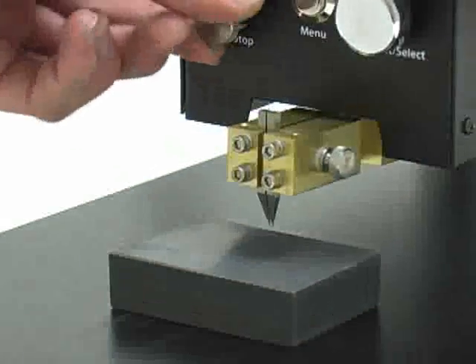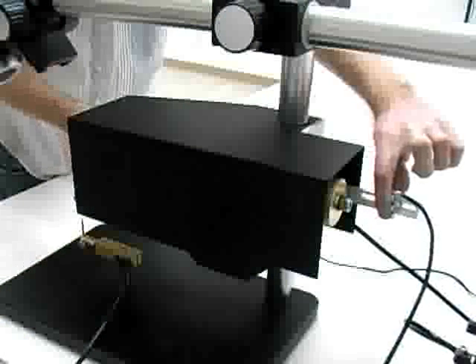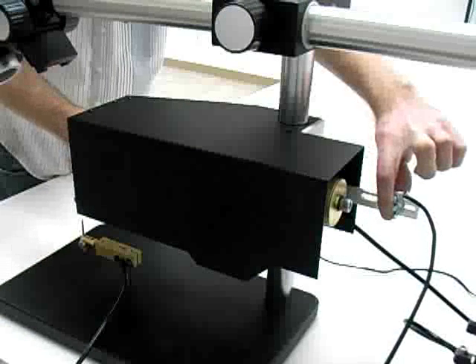Use the upstop to lower the electrode to the desired height above the weld plane. For the manual weld head, the upstop needs to be adjusted in conjunction with the manual foot pedal slider mount.